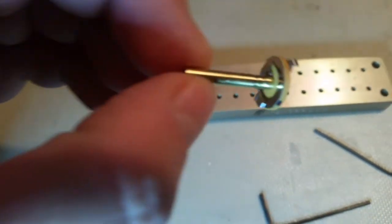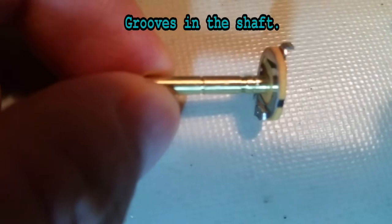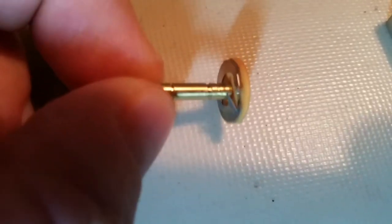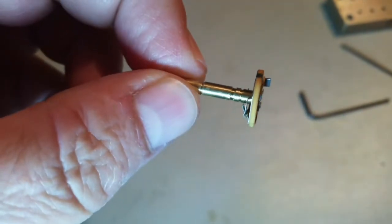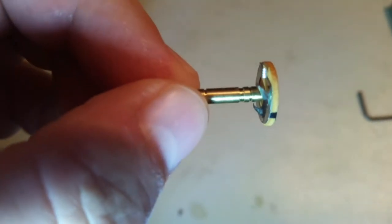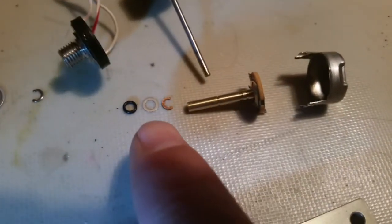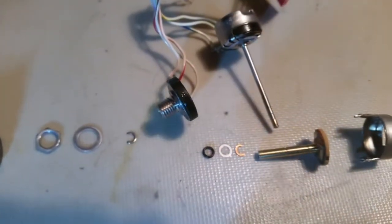Let me get a close-up of the grooves here. That one in the back is actually deeper than it looks on the video. It's actually flat — I think it's because of the things around it that are making it look not as deep as it is. But it doesn't really matter, it's fine. This is how it goes: first, you put the snap ring on in that groove way in the back. Then you put the little washer on there. Then you put the packing on there, and then you shove it through this thing.